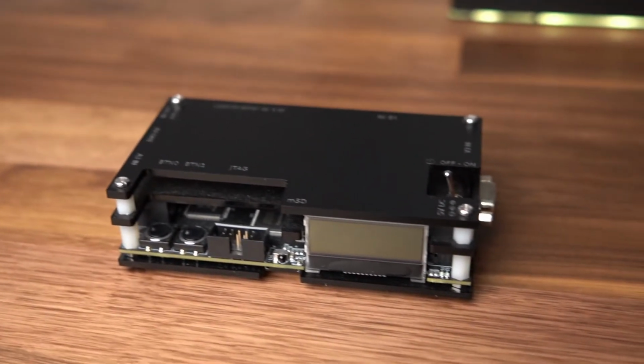The OSSC, or open source scan converter, is sort of the tried and true upscaler that a lot of people use nowadays. It can do line doubling, tripling, quadrupling, and quintupling depending on the console that you're inputting. It has both SCART and component input, as well as VGA, and it outputs HDMI. This is perfect for our needs because we need an HDMI source to use with our next item, the capture card. In my basic Super Nintendo streaming video, I used that cheap capture card, but we are not going to use that this time.